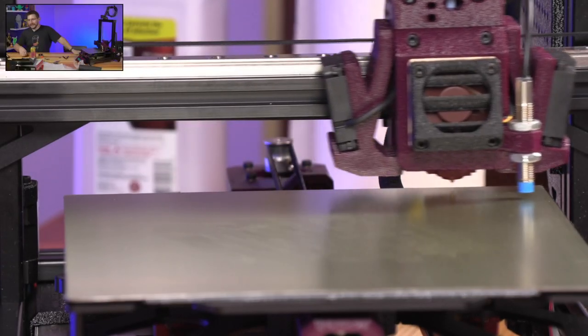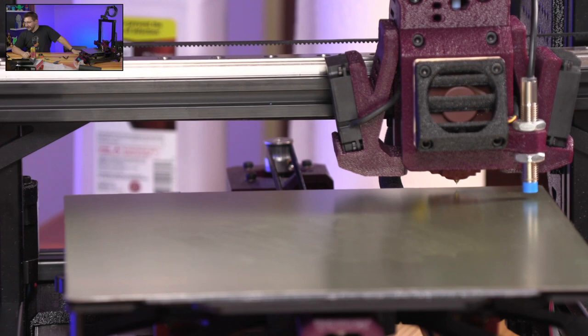There you can see it do its thing. Yeah, two screws. That'd be the way to do it. But listen, if X axis isn't completely parallel, but it's doing auto bed leveling, it just means that the nozzle isn't going to be perpendicular to the bed exactly, right? It's either going to be pushing or pulling a little bit. Isn't that right? So technically, it should work. It should work because it's judging the plane based on where that is. So it'll still work. It's just the nozzle's not going to be perpendicular to the bed. Correct me if I'm wrong.